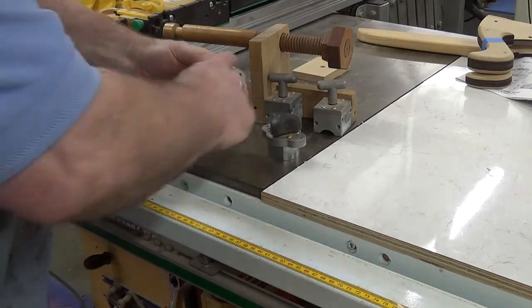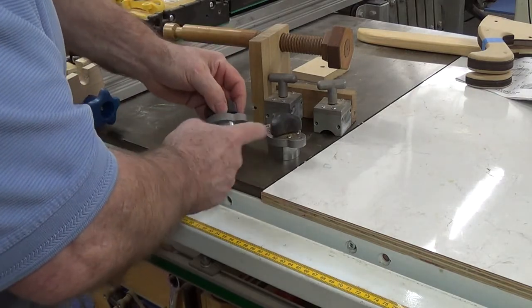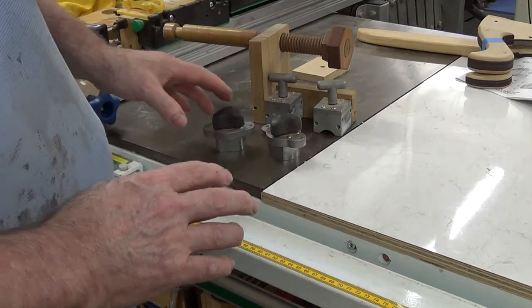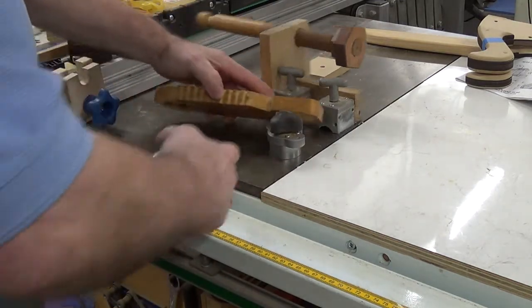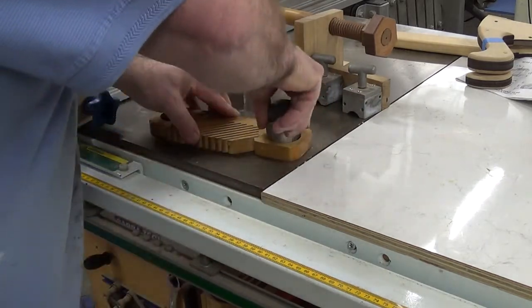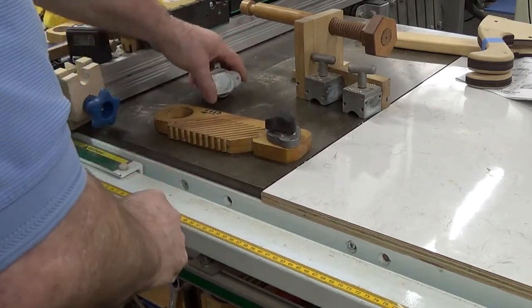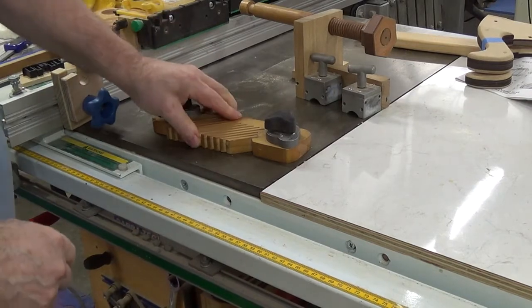These are virtually the same, except that they're round and cylindrical. They have this three-quarter inch, 19mm lip on them, so it's ideal for three-quarter inch stock. What you do is — I used to design my own feather boards — you drop it into the hole, turn it on, and you use two of them, and it holds great.